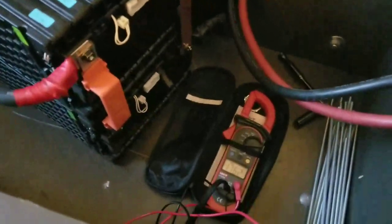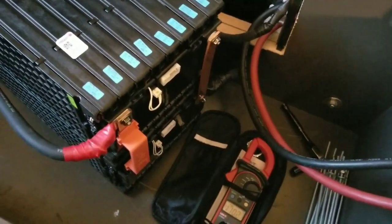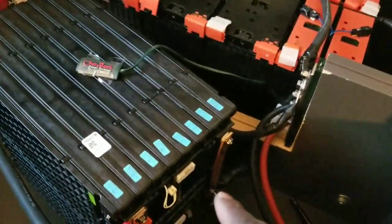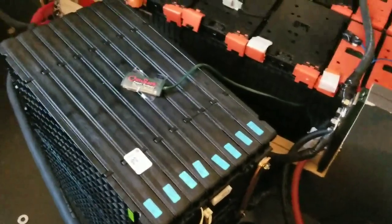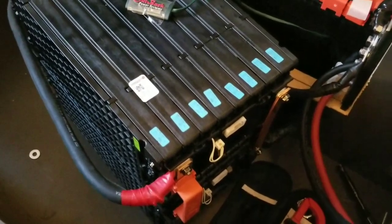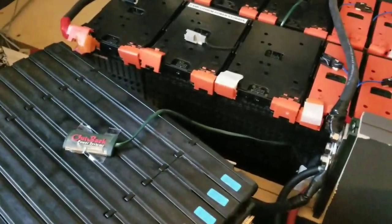I do not want to mix batteries where voltage is low — they just came in and I don't know how many amp-hours are left. You can see one is at 59-point-something and this one has been running on the system, so I don't want voltage discrepancy. Some of you might wonder why I didn't just put them all together — it's going to cause voltage discrepancy and they won't be balanced. That's why I'm charging them individually. Once they're all fully charged to the top, I'll connect them in parallel.